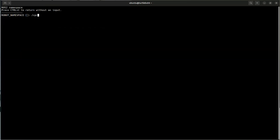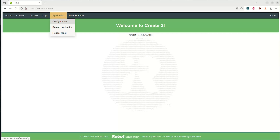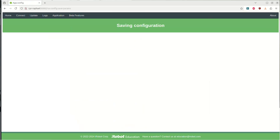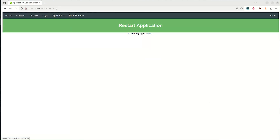After you've set the namespace for your robots, the last step is to go to the Create3 setup page at the robot's IP address on port 8080. We need to configure the Create3 firmware to use the same namespace we've assigned to our robots. If we don't do this, the Raspberry Pi inside the TurtleBot won't be able to communicate with the Create3, and the robot won't be able to drive anywhere. After you've set all of the namespaces up, reboot the robot by holding the power button and waiting for it to power off completely. Then put the robot on the dock — it'll automatically reboot and be using the namespace you've assigned.